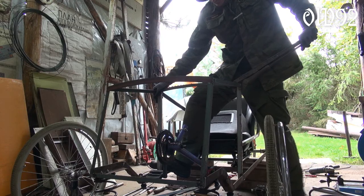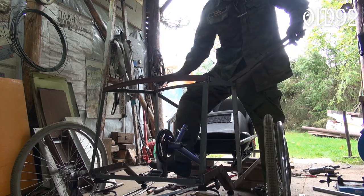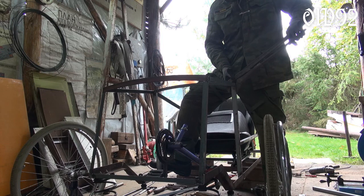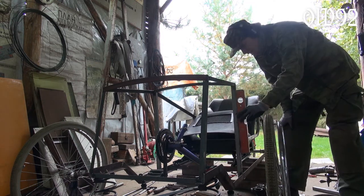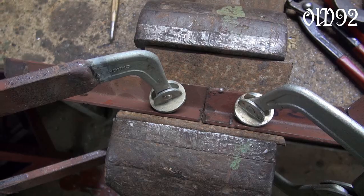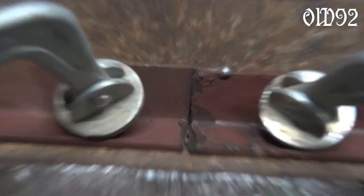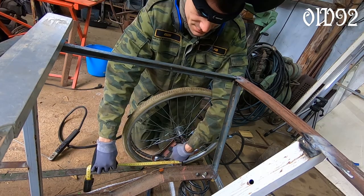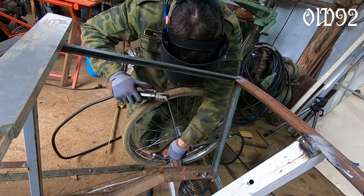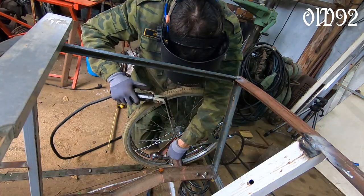Up to this very moment I spot welded just everything, so it isn't a problem to bend the frame until everything fits just like it's supposed to. Just connecting two angle irons using a third angle iron to guide the others. Here is the most crucial part — mounting those steering arms while adjusting the right angle — because I tried to use the Ackermann principle once more.